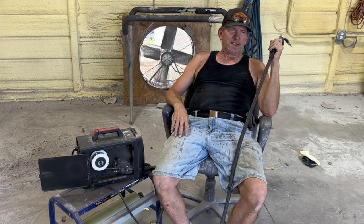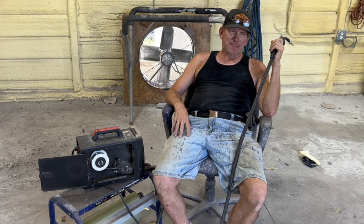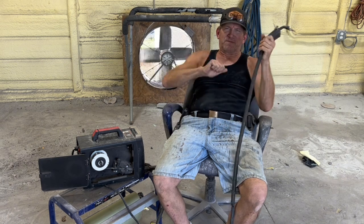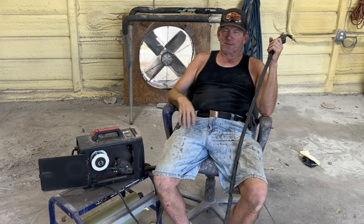That's the one I welded 26 gauge barn tin with .035 flux core wire, and then did my hammering, beating, destructing, tearing and stuff, and finally got the metal to tear, the weld to break.